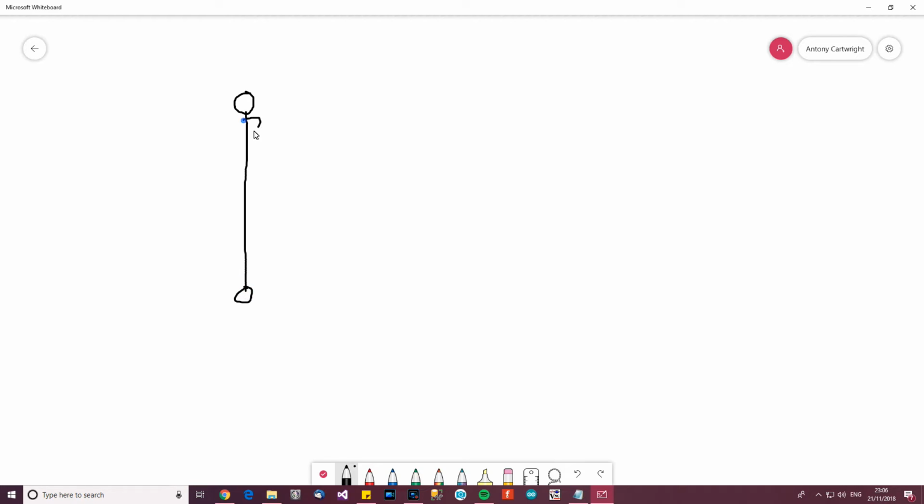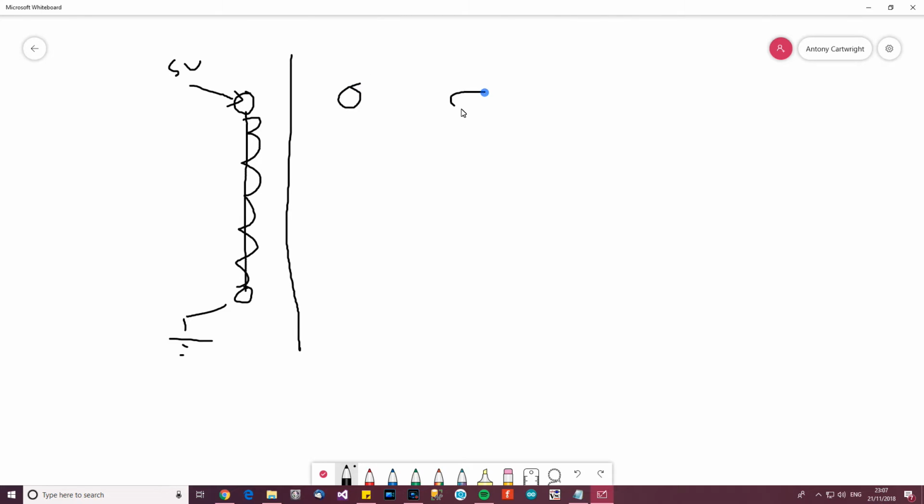So inside the relay there's a coil, and that's the symbol for coil, or something like it anyway. And you power the coil here, so we have 5 volts here in this case, and this one goes to ground, or 0 volts or whatever. And if I just continue creating the relay symbol, it's something like this. So we've got, in my case, 2 possible connections, and we've got a common. So that's C for common, and we've got A and B.